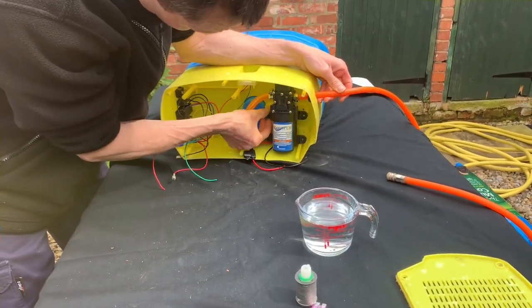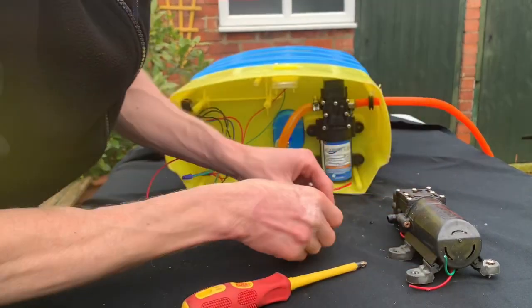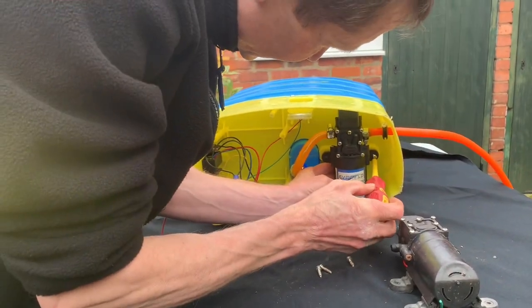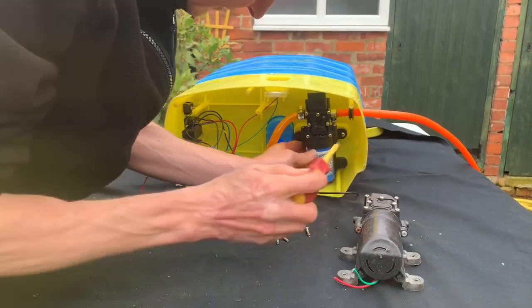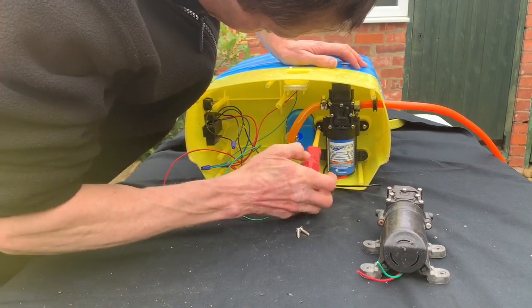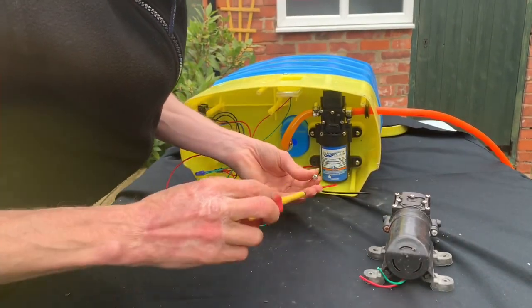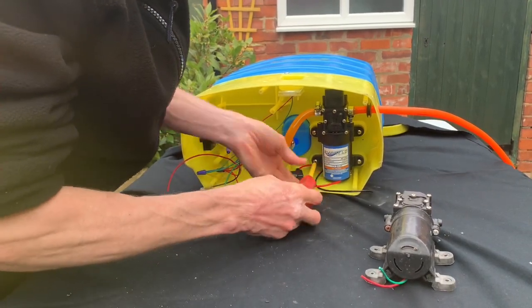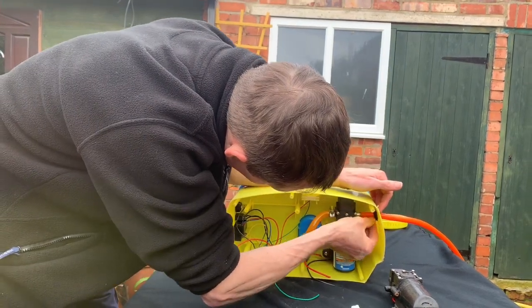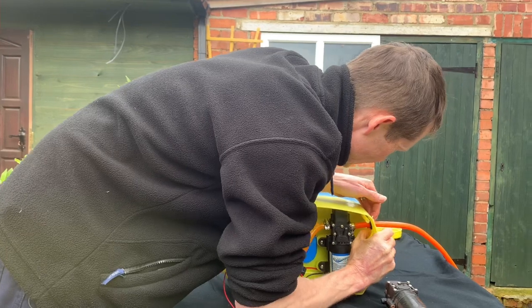You'll find the rubber feet have got a little bit of adjustment but nine times out of ten they do line up. The little screws that held the old one on are the ones you need - just like for like. What I tend to find is if you get all the screws in first, you know it's all sitting correctly, and then you can fire them all on together. So what you see now is the pump actually fitted to the backpack. I'm just going to put this little rubber grommet back together - just feed it round so it all sits nice and looks well.